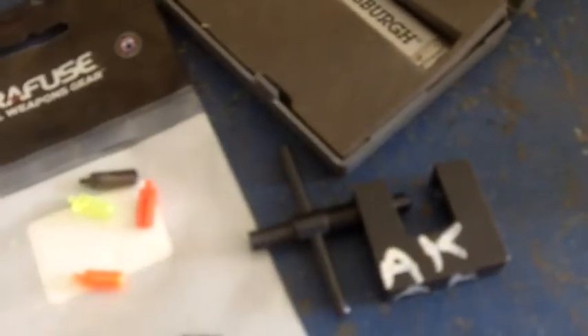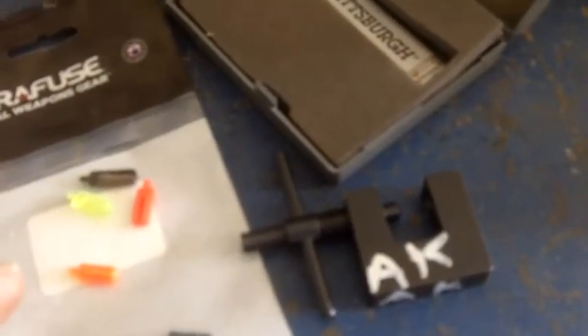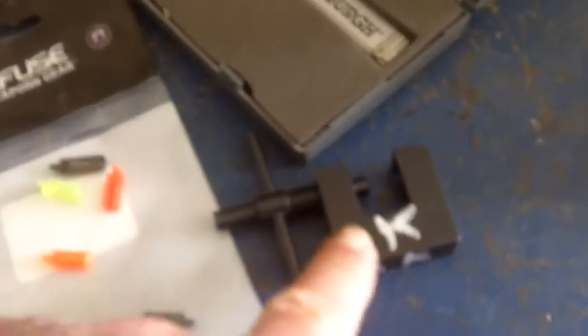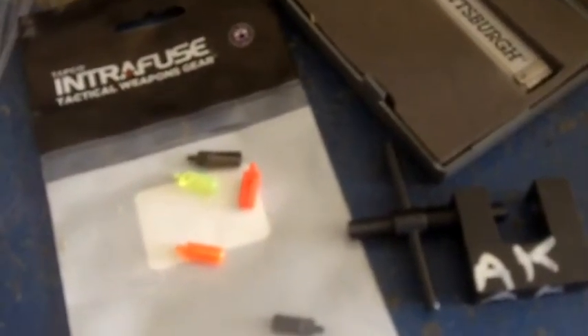You get one, two, three, four, five sights counting the one in my gun, and this is the standard one in the set. If you don't have one of these adjustment tools, it's got a little C-deal to move the front sight if yours needs that. The tool up here you set on top of the sight and then screw or unscrew it depending on what you need, then hold on this and turn the T-handle. Three things I'd really recommend before you start: get a caliper with a depth gauge, an adjustment tool, and the replacement sights.